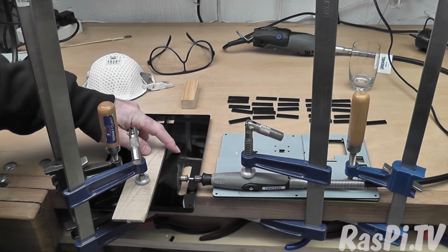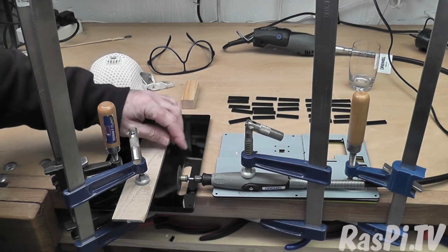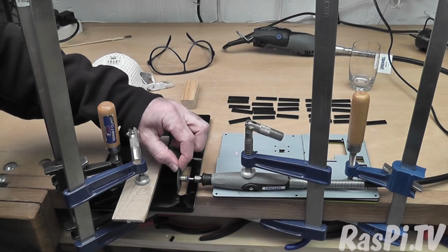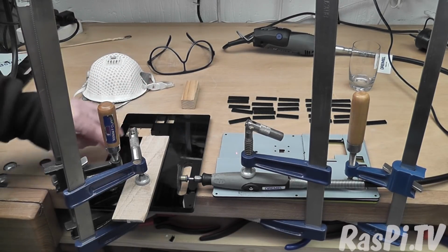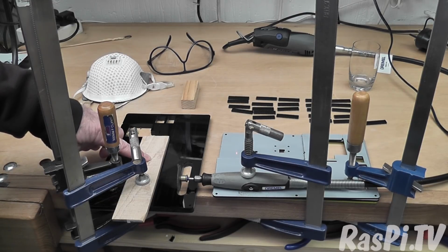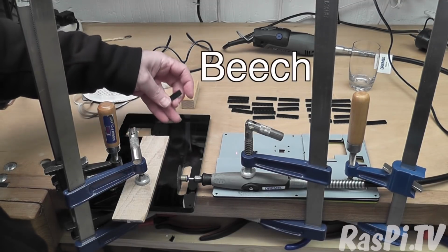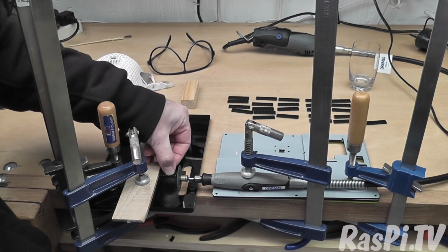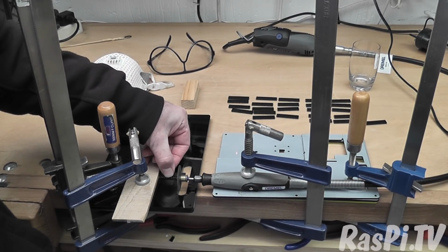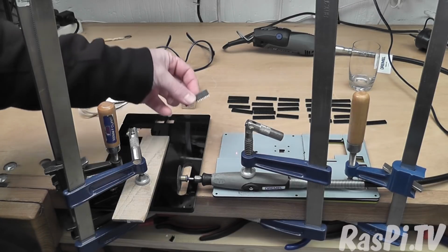On the other side we've actually got the working surface. So we've got, I think, 3 plates of perspex with slots so that the disc can spin nicely. Then those are clamped to the bench. Now here we've got a fence clamped to the surface, which is basically just a piece of thin birch with a nice straight edge, and it's clamped at exactly the right distance to cut off exactly the number of pins that I want removed and leave us with what we've got, which should be 13.